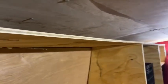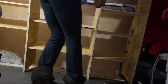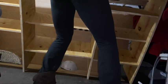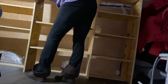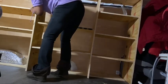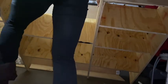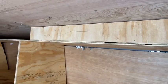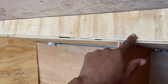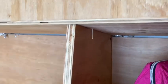Here I'm marking out the top piece of wood. It was longer so I marked it out and cut it down, also cutting the edge so it could fit perfectly. Now I'm going to lay my shelf down after making it sturdy with all the shelves in between, so I can attach the top and bottom parts. This was actually a lot of work — I had to prop it up on one end, nail the top on, then prop it up again to get behind it and nail the bottom.